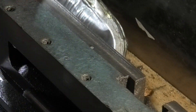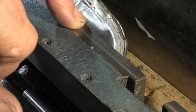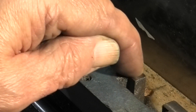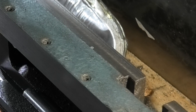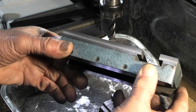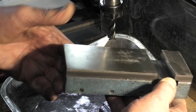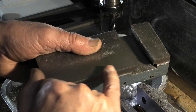There I have a nice flat surface. The finish is quite good — it's not brilliant but it's flat enough to run a dial indicator across. What I'll do next is turn it around in the vice to the other side and then reassemble it. I'll take the sharp edge off this corner all the way across with a file.